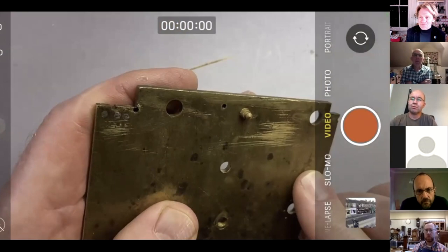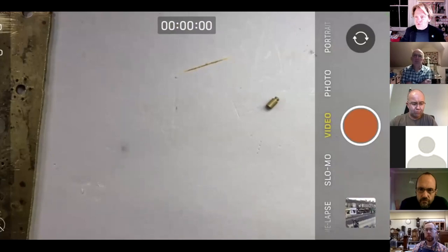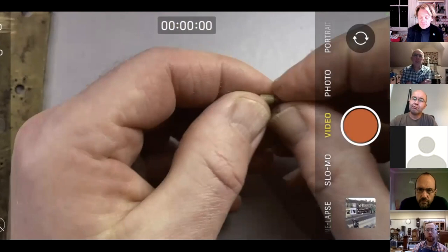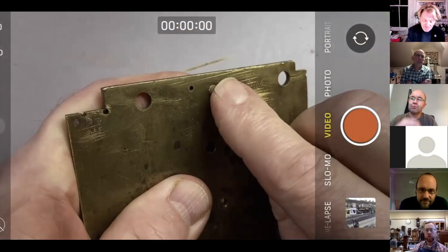But what we can also do is make the component bigger, using all these terms very loosely. If you put the component on a reasonably compliant surface and get a coarse file, you can put some knurling on it like this. It's also a good way of making really fine knurling. There are lots of people who will be turning in their graves at this kind of thing, but you can see now.